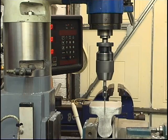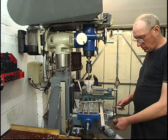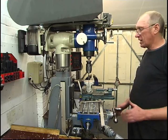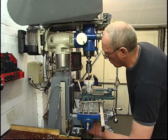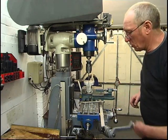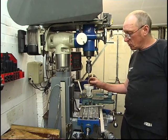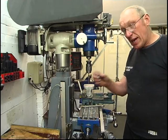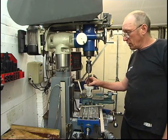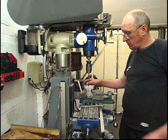I've zeroed my digital readout, and I've zeroed my Y-axis. The backlash is going in that way, so I know that's zero and I've locked it off. We've got a zero on the DRO but we can't lose that zero. I'm going to put a couple of locating pins in here that fit in the T-slot on the cross-slide. The cross-slide has 3/8 T-slots. I've got some 6mm cap heads here but the heads are just slightly too big, so I'll machine the heads down to be a good fit. I'll drill and tap two holes and screw them in, so you can use it to line things up square with the lathe, and you can also take them out so this can be bolted onto a faceplate or used on the milling machine.